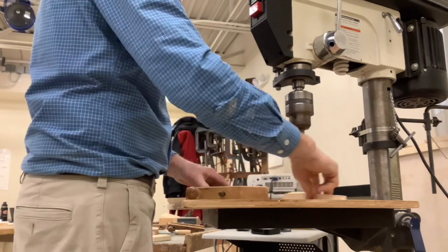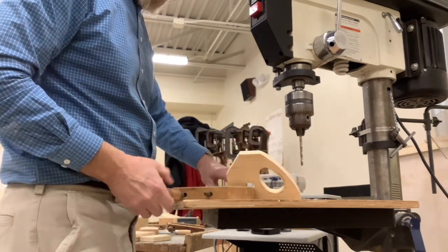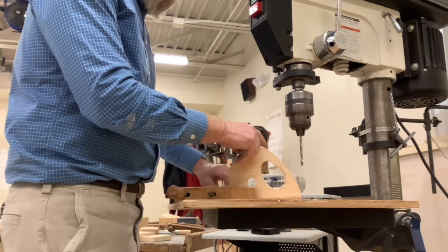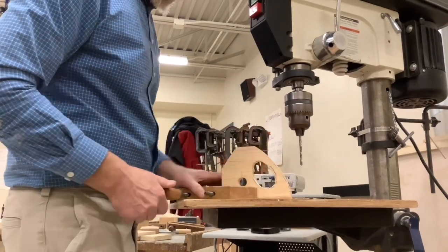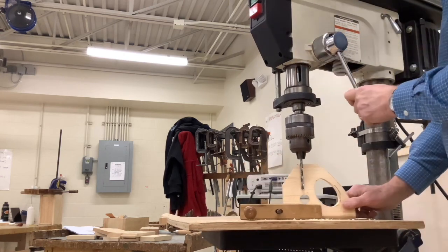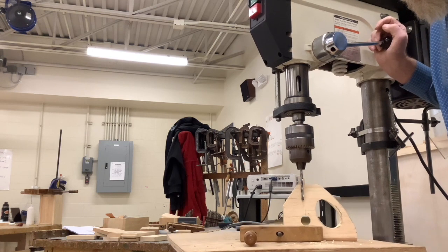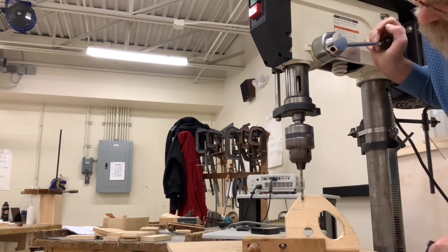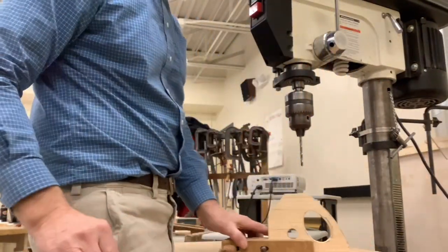The base is drilled. Now we're going to drill the top part, so we're going to change the way we hold it — narrow the clamp, keeping the jaws parallel, and get a good hold on this piece. We also have to lower the table. We're going to do the same thing: pull it down as far as we can go, going down about three-quarters of an inch. Right about there looks right, and we'll just repeat that same drilling process on the top part.